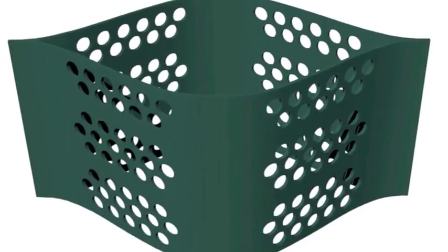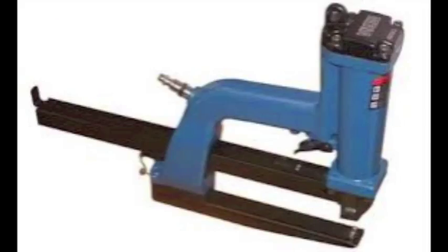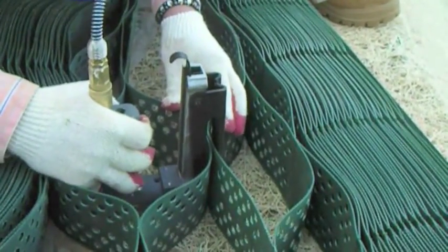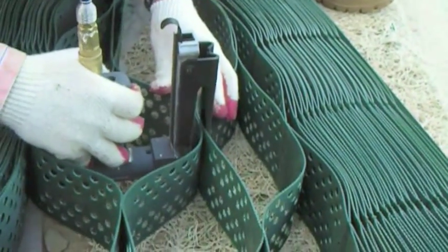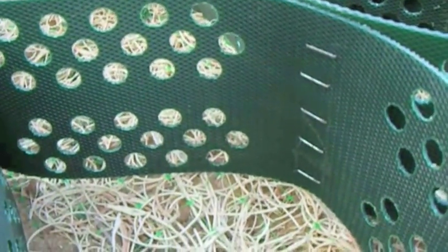When the cell depth is greater than 4 inches — 6 and 8 — you need a pneumatic stapler. This is run by air pressure and has a larger throat, usually going up to about 7 inches deep. Remember, the object is you're trying to make a weld connecting two pieces together with staples.